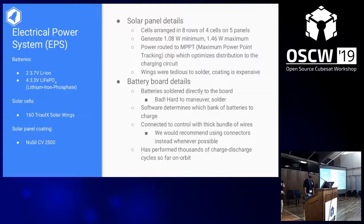For the battery board, the other aspect of the EPS, we soldered the batteries directly to the board. This was required because any other way to secure them would result in a really high voltage drop. But it made maneuvering very hard — once the batteries are soldered, it's a giant chunk taking up about 50 percent of the internal volume, including wires that were super hard to handle. We would recommend using connectors instead, and our next satellite design is planning on a battery holder rather than direct soldering.